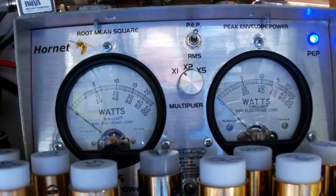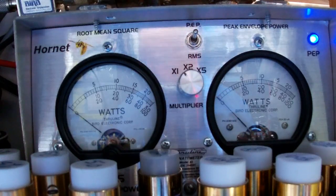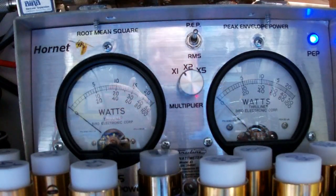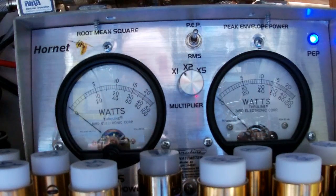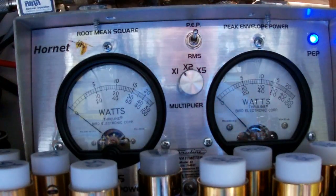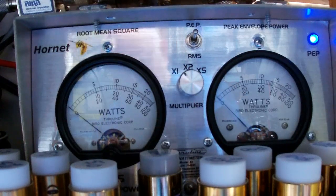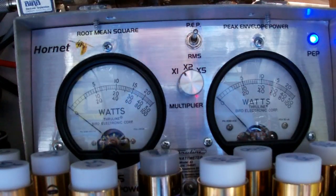But like I said, when I pull these little jumpers off and check the voltage, to reset the voltage, I need to change my procedure around where I do that first. But I usually turn it down because like on these, they had it set at, one of them was at 4.2 on the voltage. And I know these 520s are robust, but I don't trust them to stay robust with over 4 volts for bias voltage. So I turn it back down to 3.75. That's where I like to run them, 3.75, 3.8, with the first driver at 3.9. They seem to do really well that way.